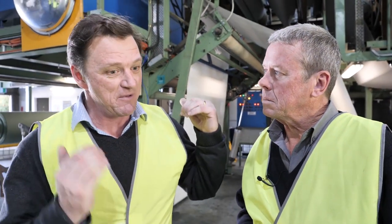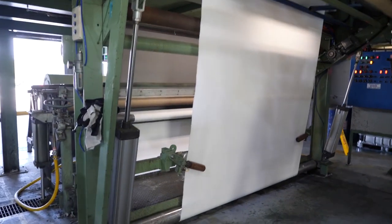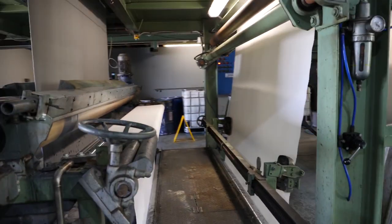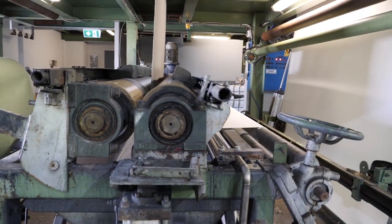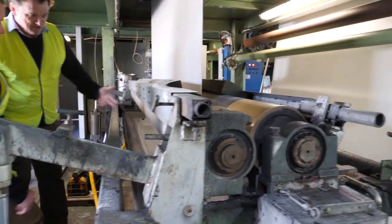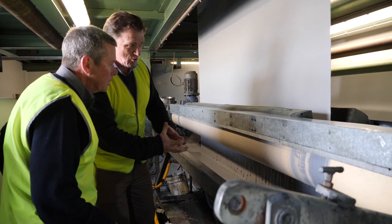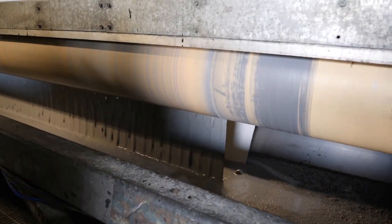You'll notice here it's a fully immersed fabric in a bath, squeezed into the rollers, into the fibres, and that'll allow for breathability and better absorption by the fibres in the weave. And then we've of course got our secret mix, which has the acrylic binder that holds together the natural pigments to hold the colour fast. We've got the waterproofing waxes, the mildew inhibitors, and UV stabilisers.